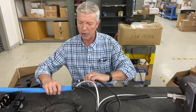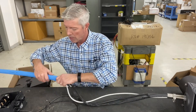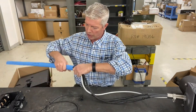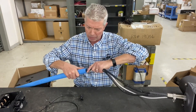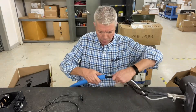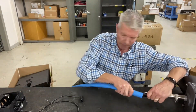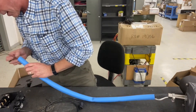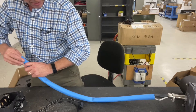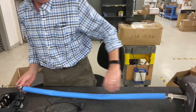Followed by your A1 and A2, which are your power feed cables coming off the motor. We're going to feed those into the blue sleeve — just little bites at a time. Feed a little bit at a time. Once the wiring reaches the end, grab the lug on the cable and pull it the rest of the way through.